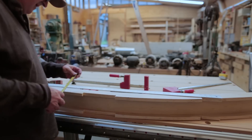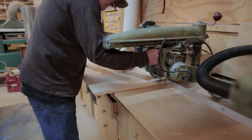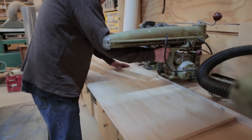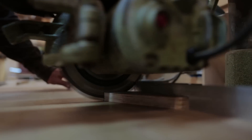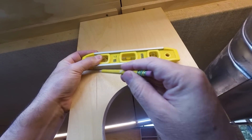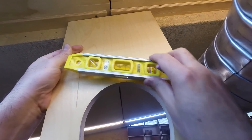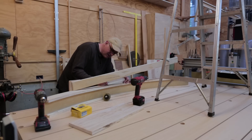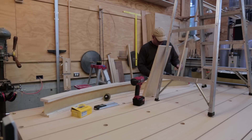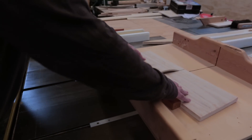There's going to be some structure to hold this to the ceiling, so I used some scrap pieces of plywood to make that structure — cutting it down and cutting the strips I needed. I'm going to have three vertical supports that this will hang from. Once I got the angle from the ceiling I transferred that angle onto those three vertical supports by temporarily attaching them and drawing the angle onto them together. Then I went back to the table saw and cut that angle into the supports to make them the right length.